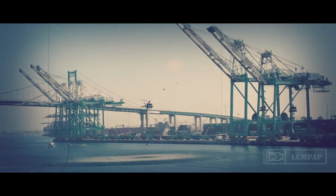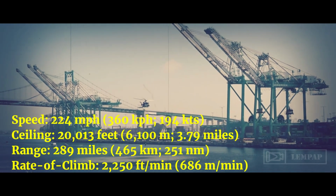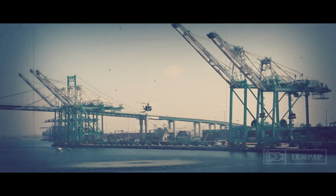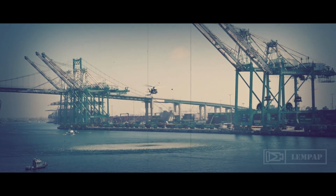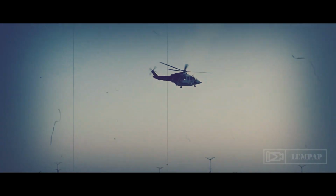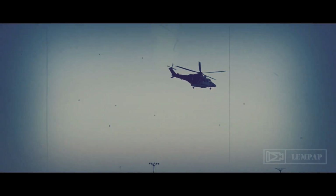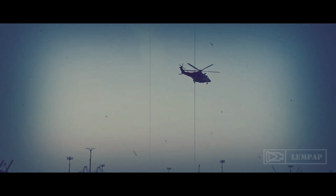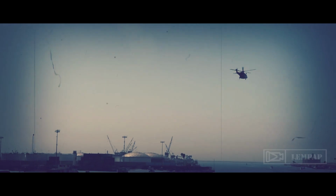The undercarriage is wheeled, fixed in flight and of a tail dragger arrangement, also designed to clear the underbelly water tank. The aircraft includes the usual window fittings to provide the best situational awareness possible for pilots and crew. The pilots enter and exit by way of hinged automobile-style doors while access to the passenger section is by way of the traditional sliding doors. Power is from 2X General Electric T700-701D series turboshaft engines developing 1,940 horsepower each.